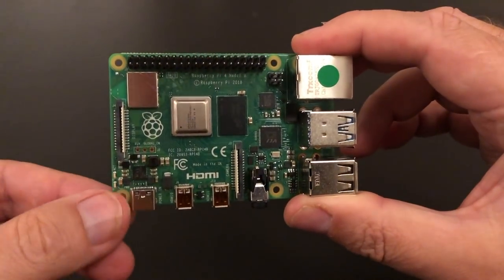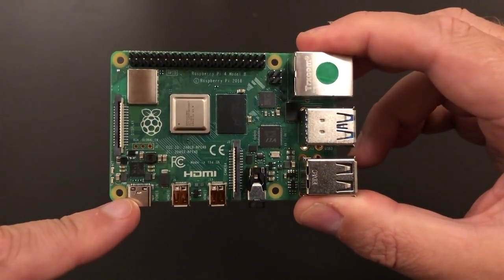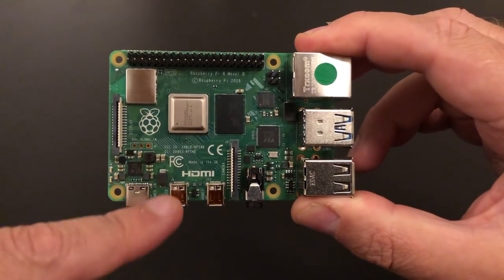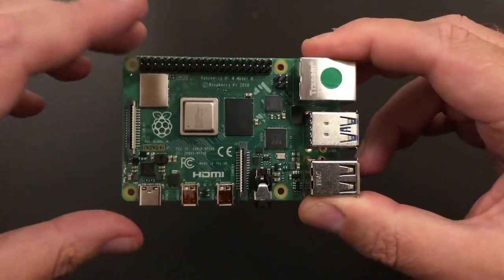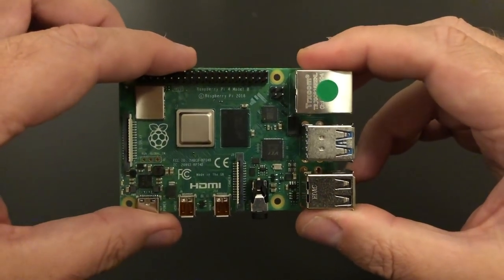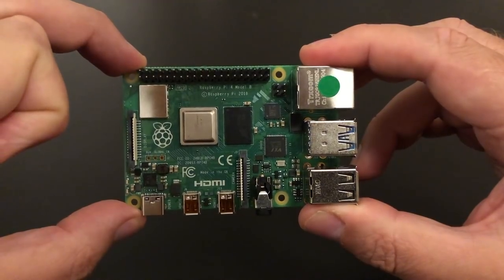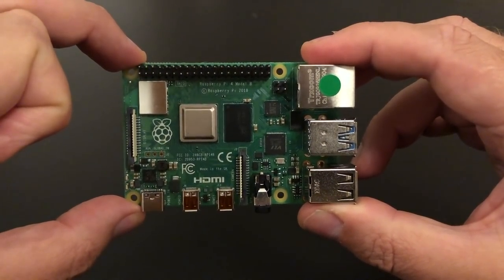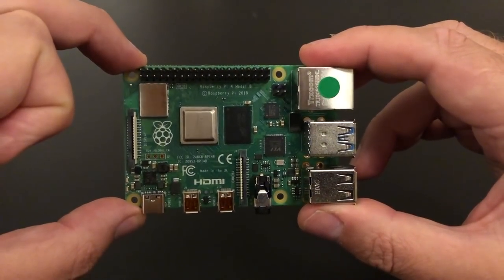On the Raspberry Pi 4B, first we have a USB-C power cable providing 5V 3A to the board. You have two micro HDMI connectors which support video output. LibreELEC is only going to be supporting one of those at the current time because Kodi only supports one output when running on the video stack that we run. On Raspbian you can run both screens at the same time.